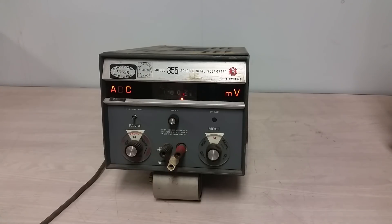That 10-turn pot is connected to a mechanical counter. It just went down, so it's trying to rehome right now and balance everything out. Yeah, I'm on the millivolt scale, so we're just picking up basically noise, because feeding it a real voltage does not seem to want to work.